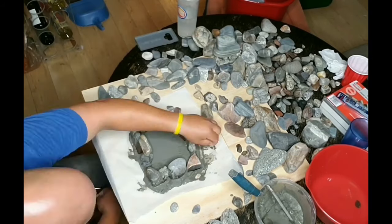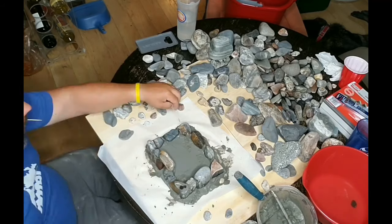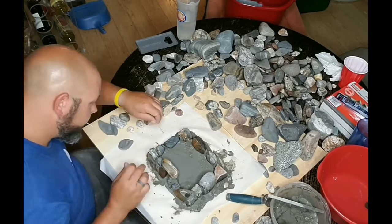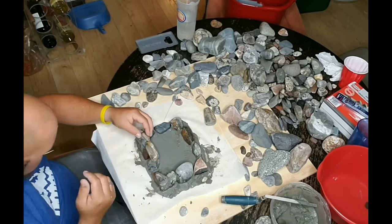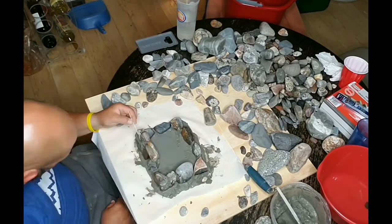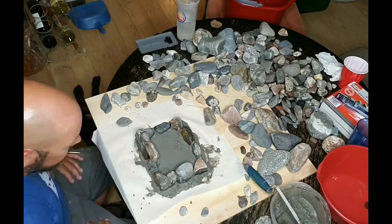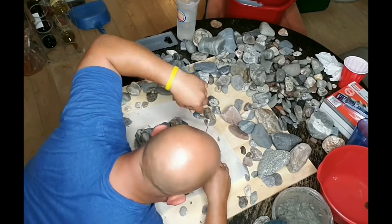You're going to see that I'm using a toothpick — what I'm doing is going around and making sure all the joints are tucked, meaning they're filled with mortar so there's no voids. Then once the mortar is set to the right consistency I scrape it away and shape the joint. Being wood, the toothpick leaves a really cool texture and it's small enough to get into those tiny joints. The regular pointing tool is just too big and will smear mortar all over your nice stones.